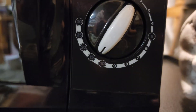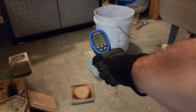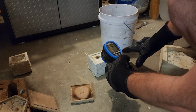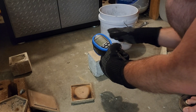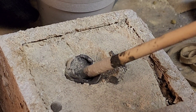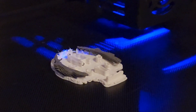This is the first time I put the kiln in the microwave. It was done so that the silicon carbide elements would harden up and not just crumble out into the refractory. I also stuffed a little aluminum piece in there that hadn't been debound before, just to see what it would do if I microwaved it without putting it in the kiln first. It didn't really work. As you can see, the silicon carbide did embed into the walls.